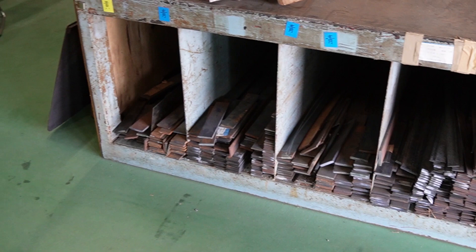It's around 20 steps depending on the quality of the knife and the finish, and I was surprised to see how many steps are still done by hand, despite the factory producing maybe something like a three-digit number of knives every day. The first step I can show you is choosing the raw material. Tadafusa works with a lot of different materials, ranging from Aogami and Shirogami up to SLD, which is actually one of my favorite steels.